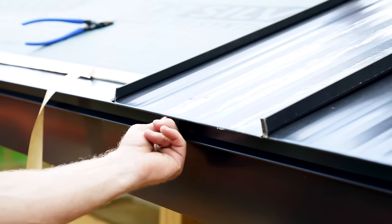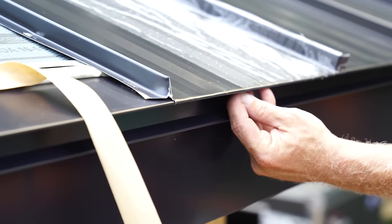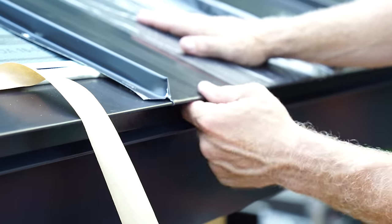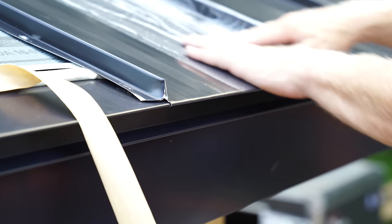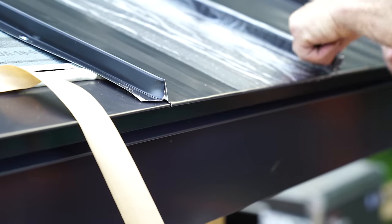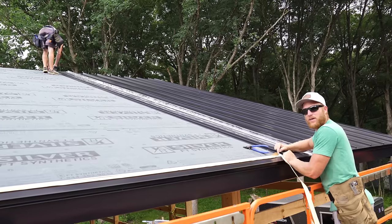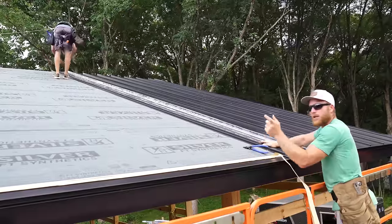A nice little light tap. Now as you see this panel get hemmed and closed tight, it can't go anywhere. These little fasteners here are allowing some expansion and contraction on the panels - even though at 23 feet it's not going to be too extreme. We're also going to put screws at the top that hold it in place, so all the expansion and contraction will happen here and this panel will move up and down but locked onto this eave flashing. It's very important that we maintain the edge of our panel on those marks we made to ensure the roof stays square.